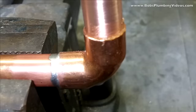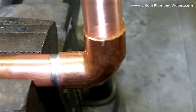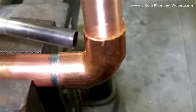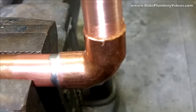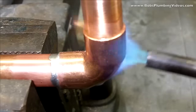Now I'll proceed. I was taught to go from one side to the opposite side with the flame, and with large-diameter pipe you're going to have to do that. But because I'm using MAP gas with my turbo tip and this is only half-inch tubing, it's going to fill up nicely and pretty quick. I'll go through the motions for you.